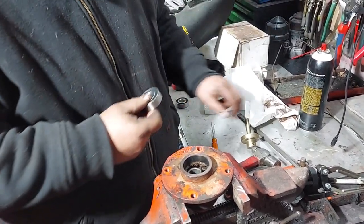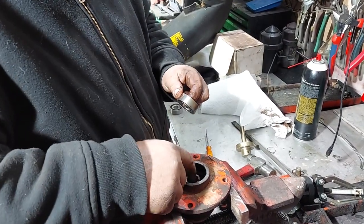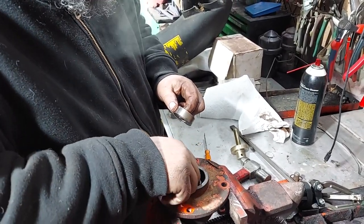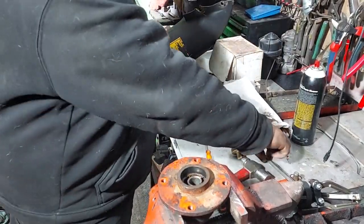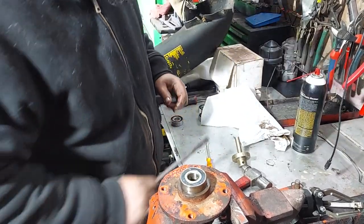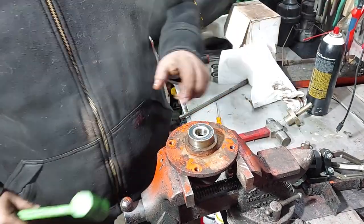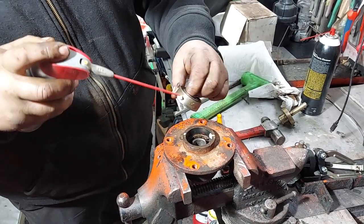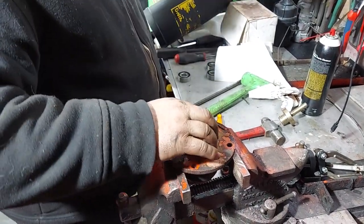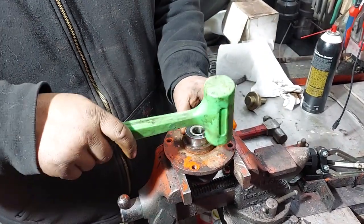You might have to make sure your spacer goes in here first. Take a little bit of grease and put it on the outside of the bearing. You want this in the center but it's not absolutely critical right now — right now it's essentially just a spacer and it's going to be kind of loose in there. You can hold it from the bottom if you're worried about it. Let me put this one in with a hammer to show you how we do it. Lube the bearing up so it slides in.